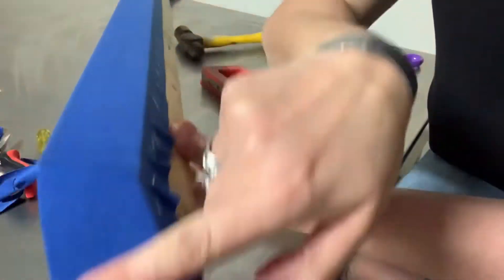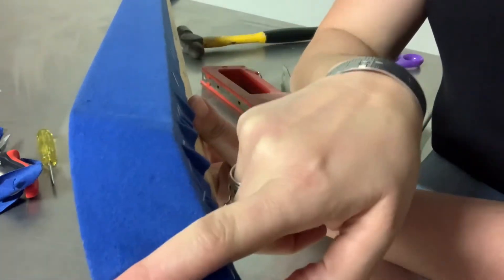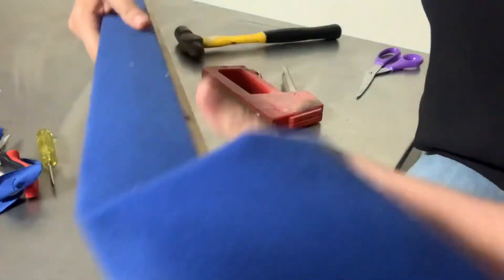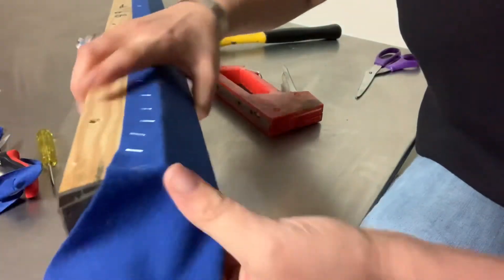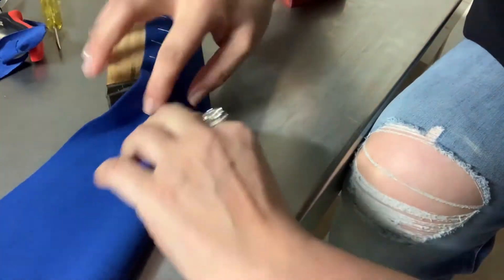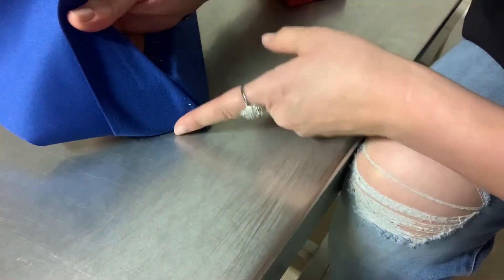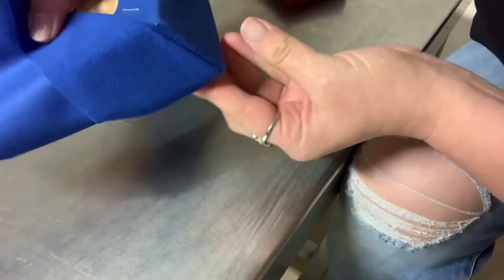I just finished — I had to pull it nice and tight so there are no wrinkles. That's all done. Now the other side: we need to put a fold in it so it's nice and tight. It's like folding a present. Come down here and have a look — push that in like that, and then you'll have a line that goes flush against here, and then staple it against there. I'm going to go ahead and staple all that now.